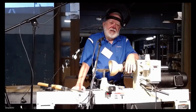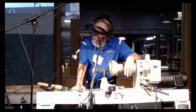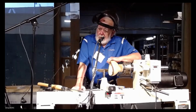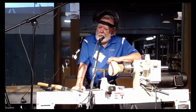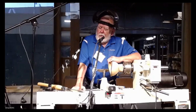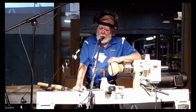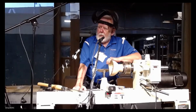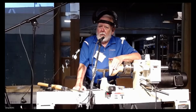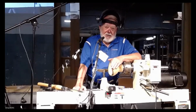What else? I put a question in chat there, Ron. Can you use the CBN wheel to sharpen carbides? Yes, Ken Rizzo would be thrilled if you did that, okay? Because carbide will eat up that CBN wheel. Check with Ken, he'll tell you the same thing. Don't do it, okay? Diamond cards are, I got one at $20, one at $25, something like that. You're going to pay a lot more for a CBN wheel than that. Don't do it. Thanks a lot, Ron. Unless you start selling. Yeah, I'm not selling CBN wheels, no, no.